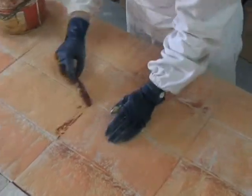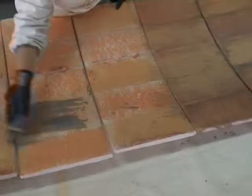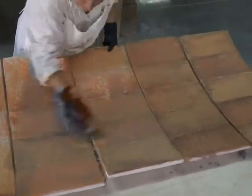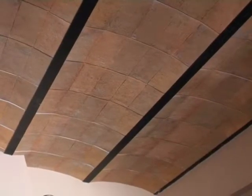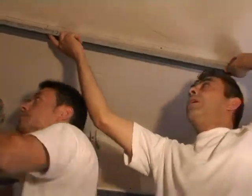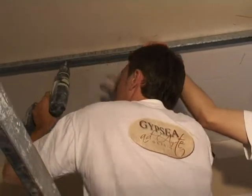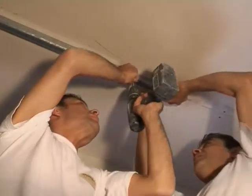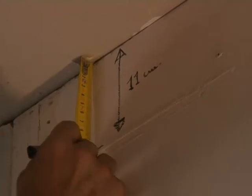For best aesthetic results, divide the room beginning from the center. This will allow for any uneven side. Decide how you wish the vaults to flow, being careful to follow the supporting structure. The U-studs will be installed in the opposite direction. The best norm is to put the direction of the vaults towards the shortest side of the room. Screw in the U-studs into the ceiling at 80 centimeters (31 and a half inches) intervals with the appropriate plugs and screws.